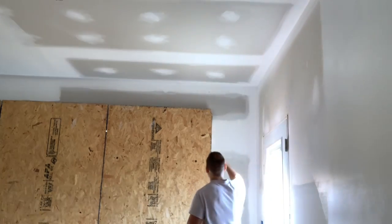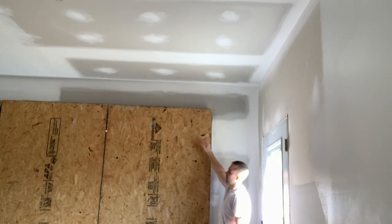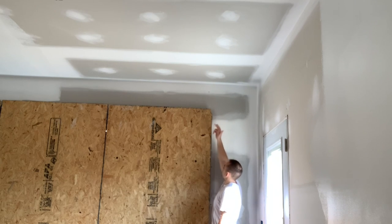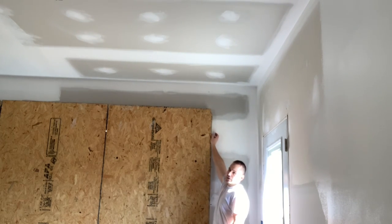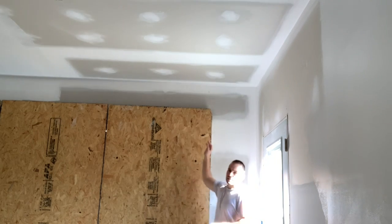What I'd recommend if you use the paint and primer combo: put your first coat on relatively thick, especially on new drywall, because it'll soak it up like no one's business. The lighting's kind of bad so the picture's kind of dark, but I'm here towards the end of the garage, almost got it done. Right here is the plywood I put up to block the weather — it comes to where I should be painting, but I don't want to cut it because I'll probably reuse it. Once I get to put two-by-six boards all around the edge for the garage door, I'll paint as close as I can and paint those two-by-sixes, then paint up to them after I install them — I'm going to make a video on that tomorrow.